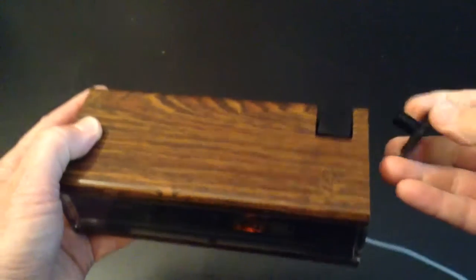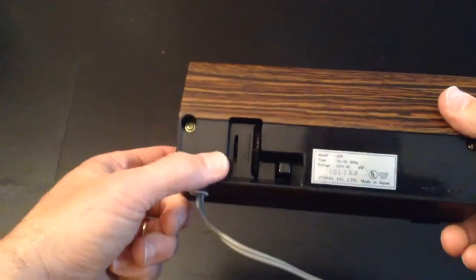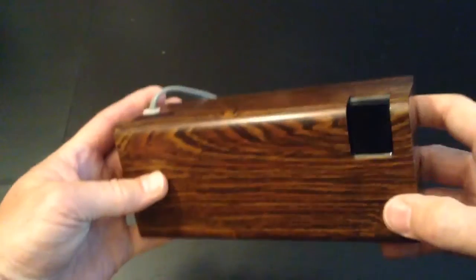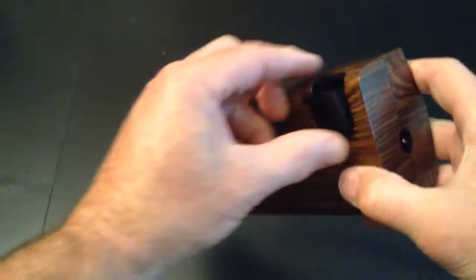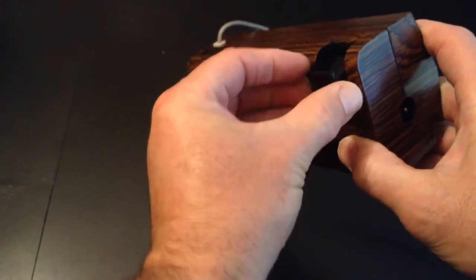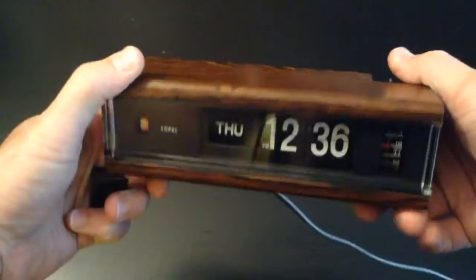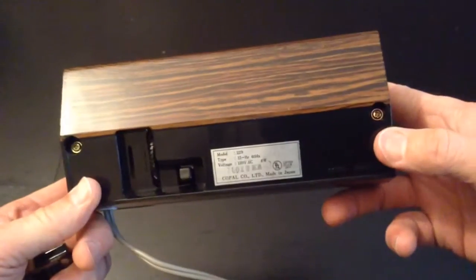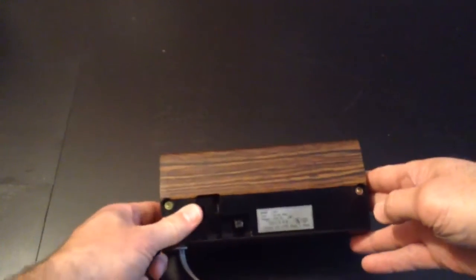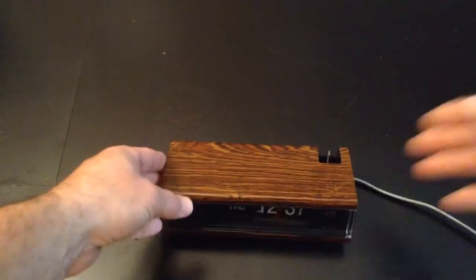What we're going to do right now is disassemble the clock. The knob comes right off — this is the part that, if you're taking the clock apart, you might get hung up on. It might be a little tricky taking that off as it will hang up the case. But it's real simple — in this case you just pull straight up and it comes right off without any problem. For further disassembly, we have to take the two screws out. Two screws are out — kind of long ones for a clock like this.